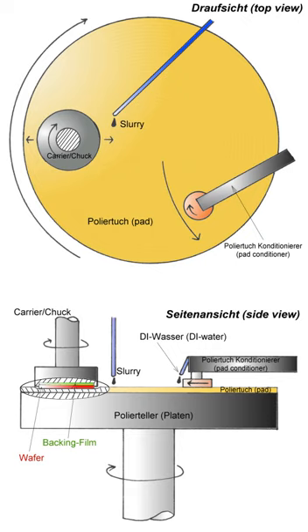The oxide polishing process, which is the oldest and most used in today's industry, has one problem – a lack of end points requires blind polishing, making it hard to determine when the desired amount of material has been removed or the desired degree of planarization has been obtained. If the oxide layer has not been sufficiently thinned or the desired degree of planarity has not been achieved, then the wafer can be repolished, but in a practical sense this is unattractive in production. If the oxide thickness is too thin or too non-uniform, then the wafer must be reworked – an even less attractive process and one that is likely to fail. Obviously, this method is time consuming and costly since technicians have to be more attentive while performing this process.